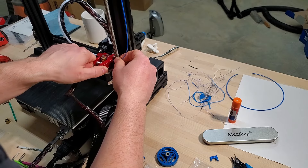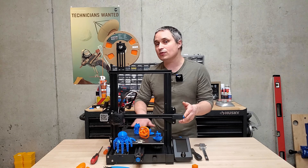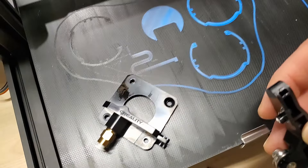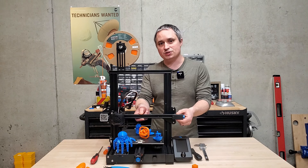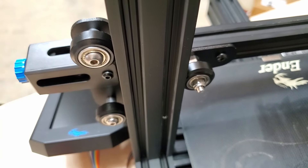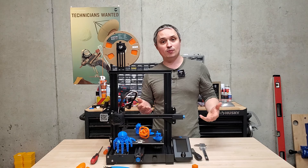However, that wasn't the only problem I was having with the under-extrusion. Even when I leveled the bed and made sure it was perfectly level, the nozzle was actually crashing on the far side. My compound issue was also that the z-axis wasn't tight enough on the gantry — these rollers have an eccentric nut on them. You just turn it until they don't slip anymore, and that solved my problem.